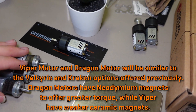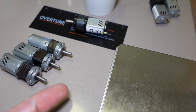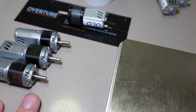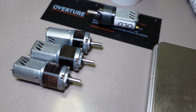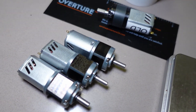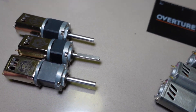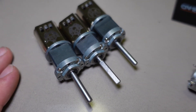I wasn't quite happy with this because the short shafts were a little bit too short. I wanted it to be possible to add a bearing support and still have the shaft stick through, or maybe have two pulleys stacked up, or a pulley and a wheel. I'm also getting the heat treat on the shaft changed to make it less likely to snap. I decided to have them coat the gearboxes black — the initial samples were uncoated. So next I got this round of samples, which are now the final production version of the gearbox with a black coating.